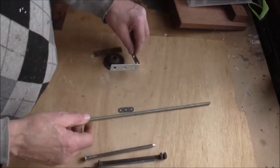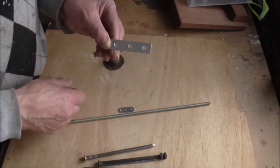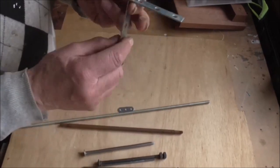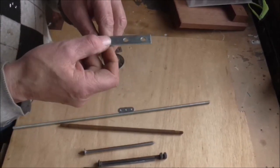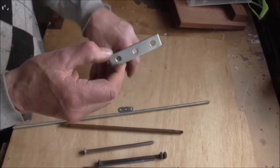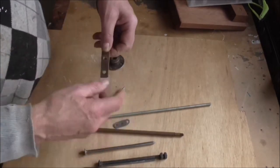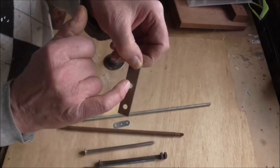These are various brackets you can use. If you've got a nice centre hole, you can use that on the top and bottom of the whirly gig where the rod comes out — it'll stop the rod wearing the wood away. You're better off with the angled one cut off, because the straight ones often have holes that aren't in line and are more awkward to use. You don't have to buy these — just take a bit of metal and drill three holes in it. I've also used a bit of Meccano as a plate on the top just to protect the wood for the rod to come through.